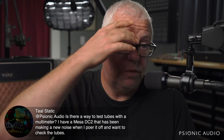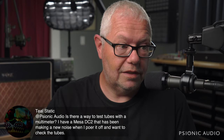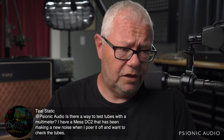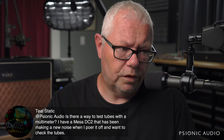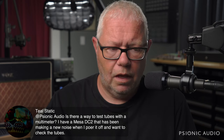I suppose I should read these questions for those who are listening rather than watching. Teal Static asks, is there any way to test tubes with a multimeter? You can check for dead shorts, but other than a dead short situation, you're not going to get anything meaningful with a multimeter. Tube testers measure an awful lot more than just that.